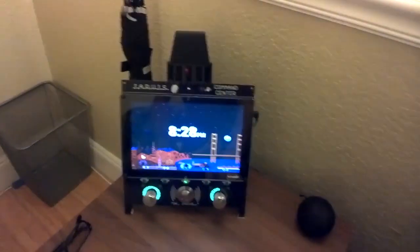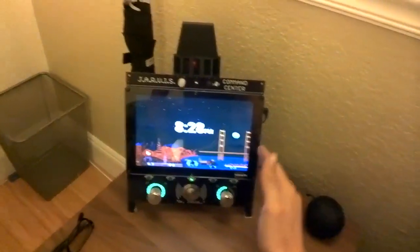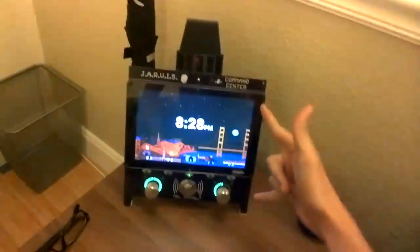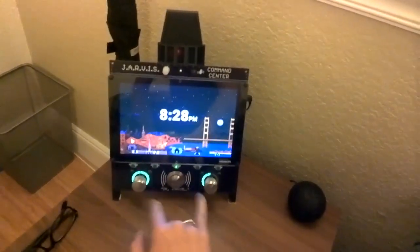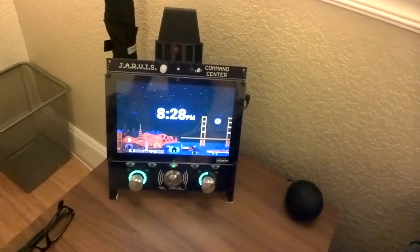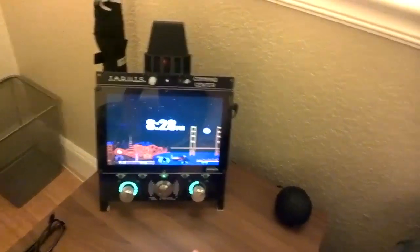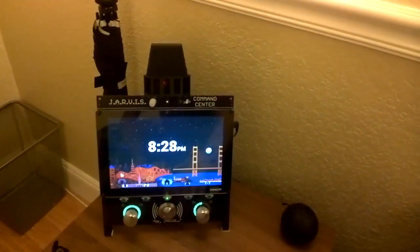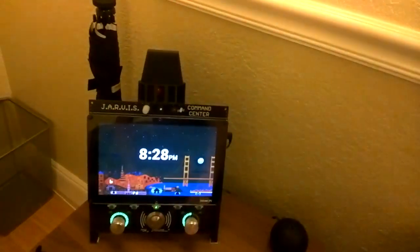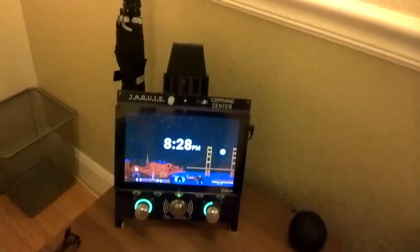This is the command center, which I built from scratch. It uses a combination of a Raspberry Pi, an HD display, and two custom circuit boards that I made with microcontrollers to control the lights, dials, and buttons on this interface. It also includes a passive infrared sensor to detect if someone's in the room. If someone's been out of the room for a long period of time, it'll automatically turn the screen off to save power and reduce burn-in. It also has temperature and humidity sensing, as well as a gesture sensor that can sense gross gestures for things like silencing the alarm clock.